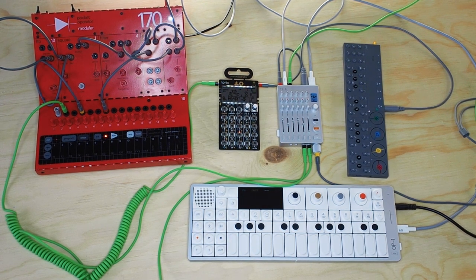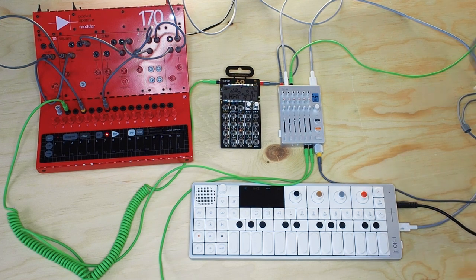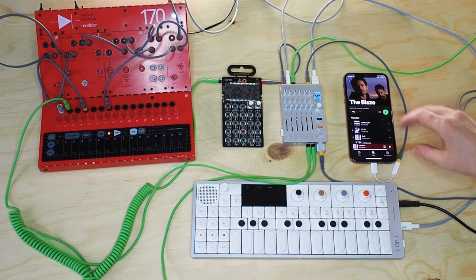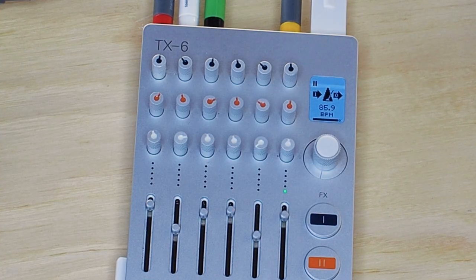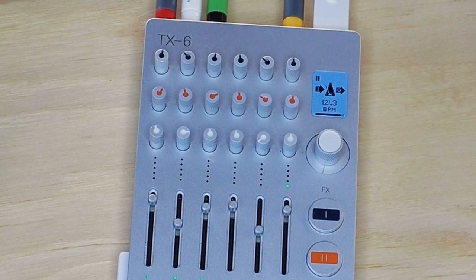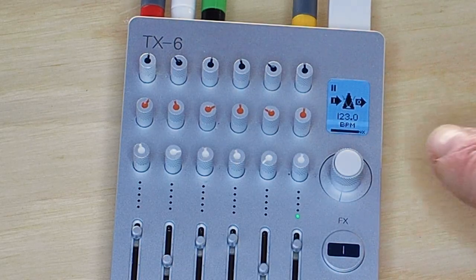There's also a new really cool feature called beat tracking. It can detect the tempo from an incoming audio signal and use that as a clock input. This is really cool for live mixing a song from a vinyl record player, or for an old drum machine that has no suitable inputs or outputs for clock sync. I'm going to try this from my iPhone, connecting audio out still into track six. It will analyze the audio and set the tempo. The confidence meter is higher when there's more defined beat in the song, and you can also assist by tapping.